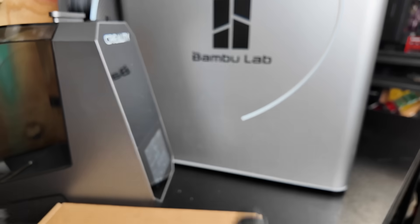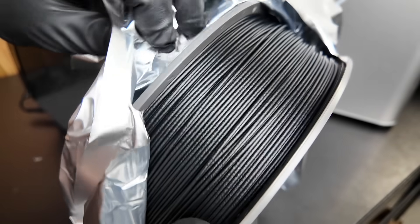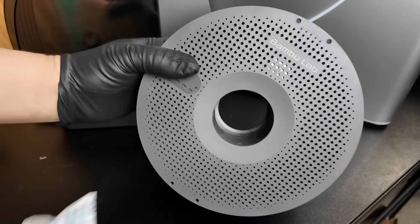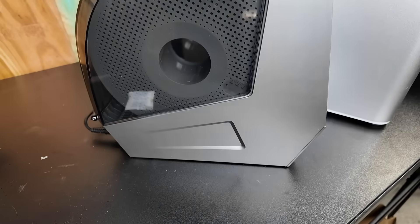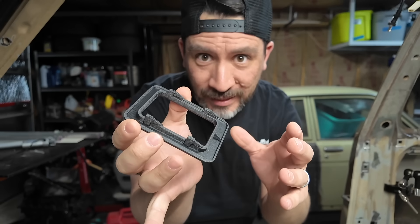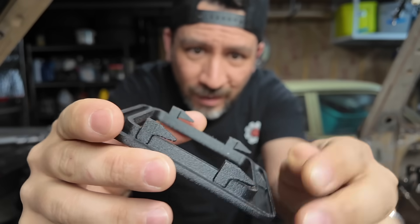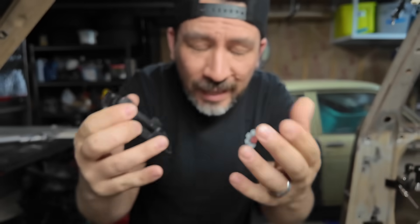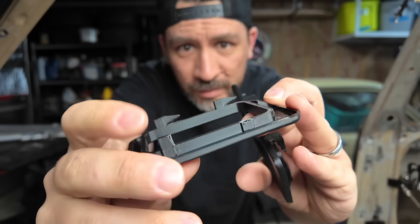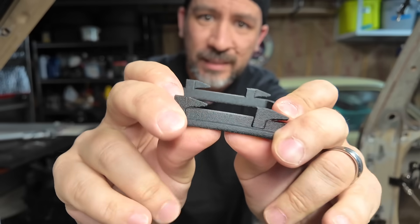For this next filament we put on gloves because we're using ABS GF, which uses glass fibers — we don't want any fibers getting into our skin when we cut the filament. The glass increases strength and temperature resistance goes from 188 to 210 degrees Fahrenheit, and we made sure to dry the filament before printing. Here's our ABS GF part — fitment is nice. The tabs are not snapping right off like the regular ABS did. It's got some flex to it, so ABS GF might be the winner.